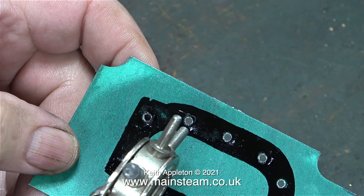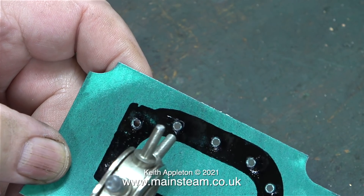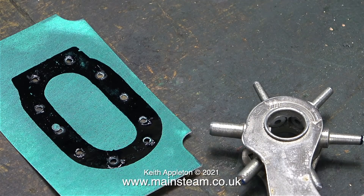The first thing to do is to punch out the holes using a hole punch. When you use the ink pad method, especially with an ink pad that's a little over-full, the ink transferred to the gasket material doesn't really dry for a long time, so you have to be very careful not to smudge it with your fingers. This is what it looked like after I'd punched out all of the holes. There's nothing wrong with the hole on the left-hand side — what you can see is the punching that fell out of the punch and sat on the ink.